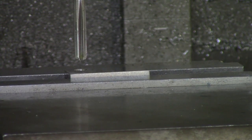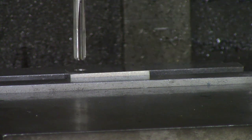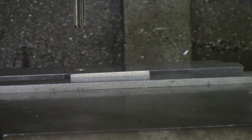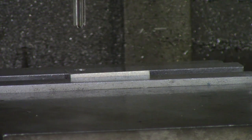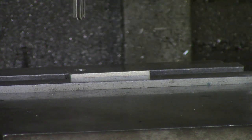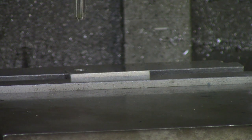That's really all you need to know when it comes to reaming. You want to drill it smaller, have your spindle speed going slow, make sure that you're tight on your chuck, and it's going to follow your drilled hole. If you're drilling really fast and it starts to lead off at an angle, your reamer is going to ream at that angle. You can stub up on your reamer as much as you can to keep it as rigid as possible, and that will help a little bit. But if you want it to follow the drilled hole, you can hold on to about a half inch of your reamer in your chuck, tighten up on it, and let it just follow the hole.